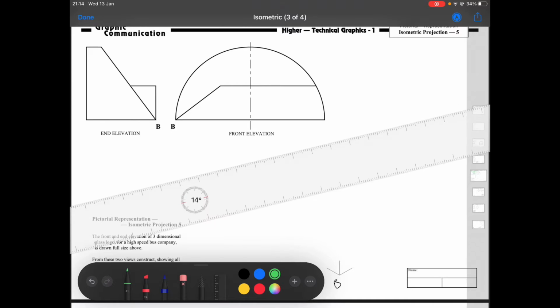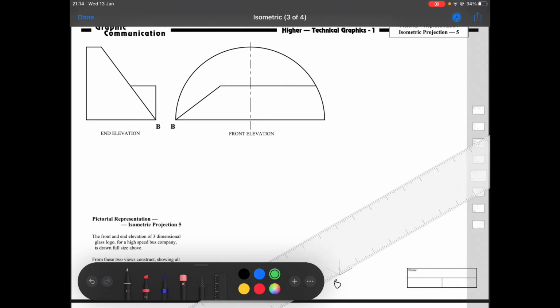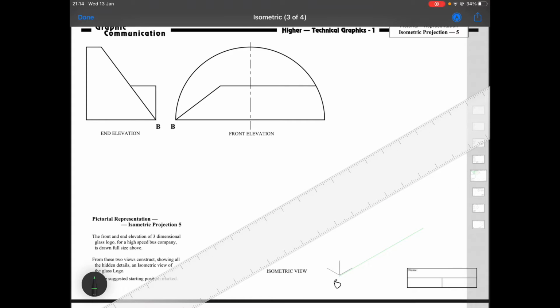Usually I talk about creating first, but in this particular case, because we've got the slope on here, we're going to just work on the back face first to get that curve drawn in, and then we can project those sizes out from a cut point and measure forward. So there is a wee bit more measuring in this one, but I don't think it's outside anyone's ability level.